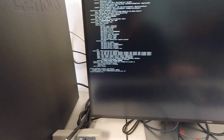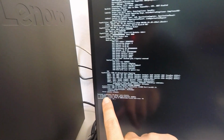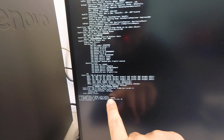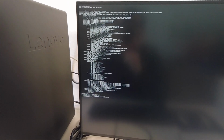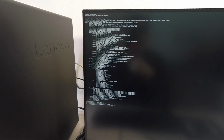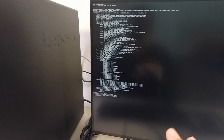All right, so the driver says, hopefully you guys can see that, I'll read it to you. It says Atlantic: bad FW firmware version detected 402001D. Probe of that address failed with error -95. So it seems like the current firmware version of that Aquantia AQC107 chip is not playing well with the driver that's in Linux right now.